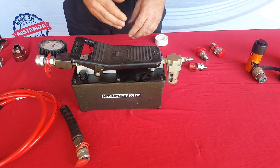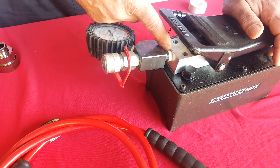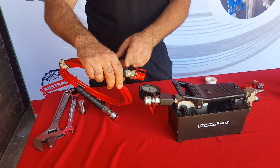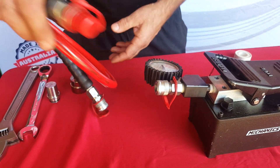You can see how we've installed them here. On the other end, on the hydraulic side, you'll come with a normal little red cap on the end. What you do is you unscrew that out. The hose will come in — we've got a quick connect fitting on here, but the hose will come in just with a screw thread. You take your cap out, you screw your hose directly in and that side's done.